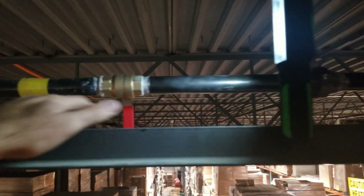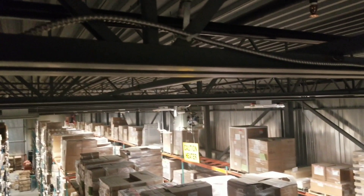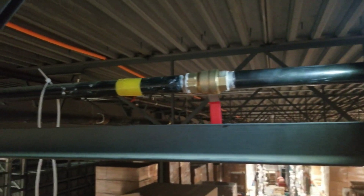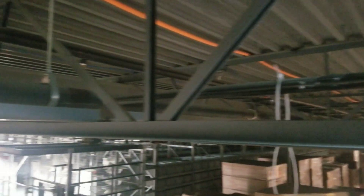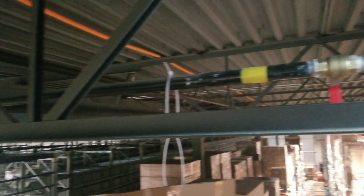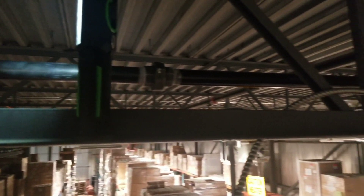What we're going to do now is turn the gas back on here. We're going to purge the gas back at the heater over there, get the heater running, and then purge the rest of the machines — because we shut down the main gas valve to the building since we were on the main line and had no isolation. So we shut the main gas off to the entire building and we've got to go purge the gas back to each machine and make sure it fires up.